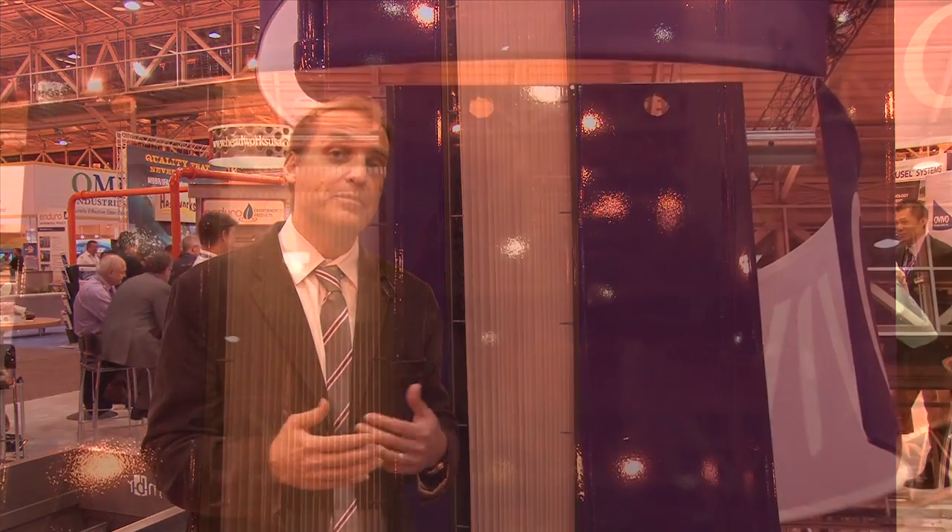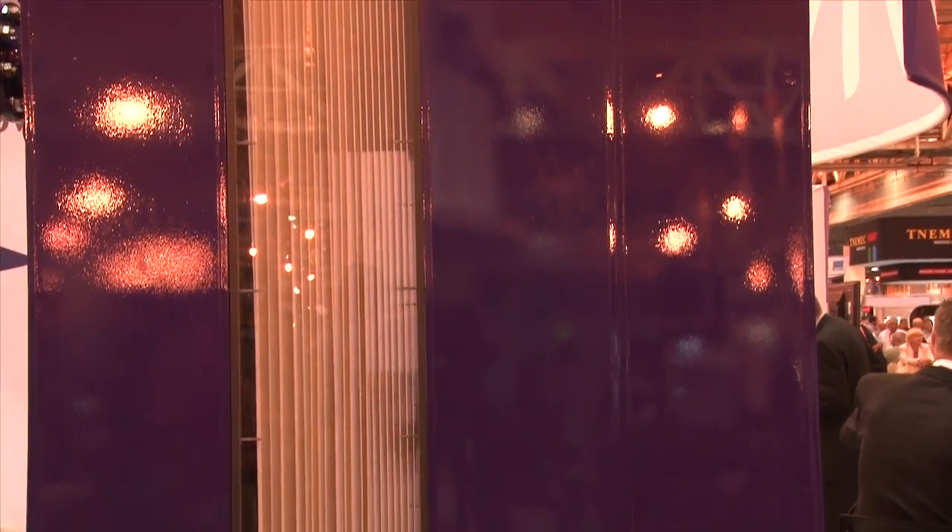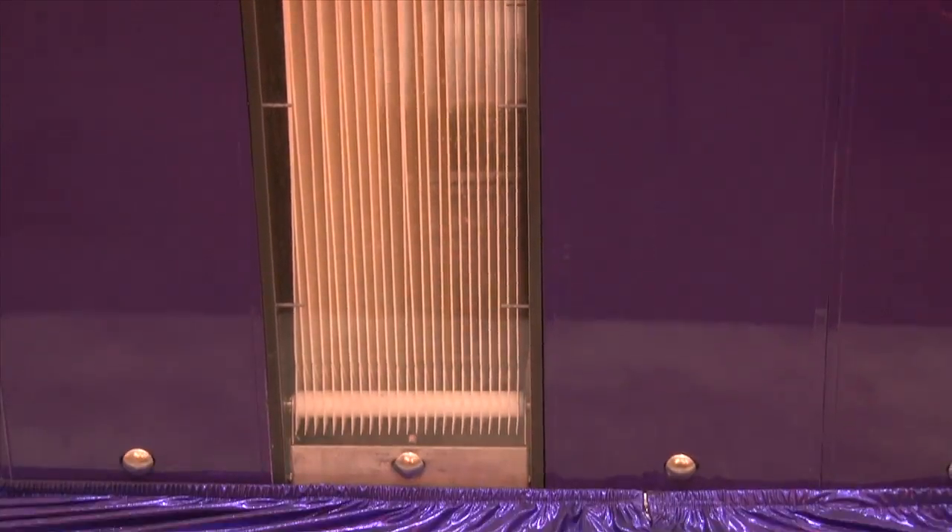So there are some advantages to that. As you can see here, there are 25 sheets and those sheets are two millimeters thick and they are separated by eight millimeters. The four membrane cassettes are assembled into a permeate module that's then put on a diffuser case to form the OV400 membrane unit.